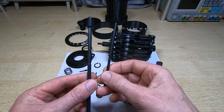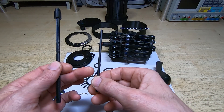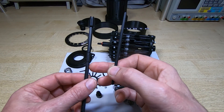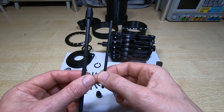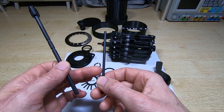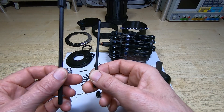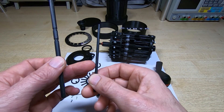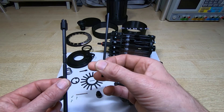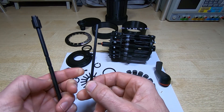On the larger unit we smooth this down until the gears fit and it's round enough to work, but at the smaller scale we need a much finer finish because that amount of roughness just won't allow the calculator to work. As we head towards a better finish, the amount of material removed becomes an increasing percentage of the part's size, because we have to remove roughly the same amount of material regardless of scale to achieve the surface finish we want.